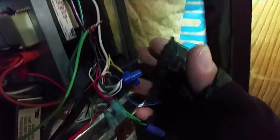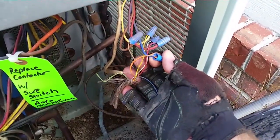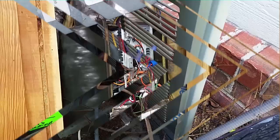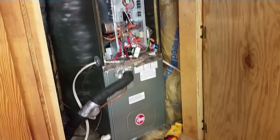So I'm going to see if I can change wires to solve the problem. I took the blue wire off that was going to the reversing valve and switched it to orange, which showed no continuity to ground. We're going to start things back up and see if that did the trick. We have the system set back in heat — it is running. The unit shut off outside, but the machine is running, which is a good sign.